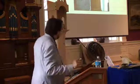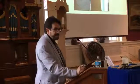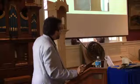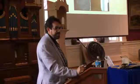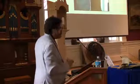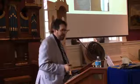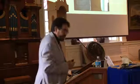It was difficult to find brushes in the period, so finishes were applied with a pad. The French called it tampon, the Spanish called it muñeca. So, it's this pad application of finish. It's quick, there's no bristles because brushes were difficult to make, brushes would fall apart. So you would pad this whole thing with shellac in the period.